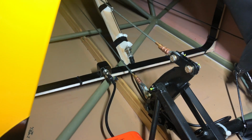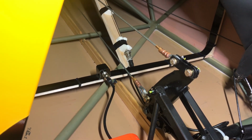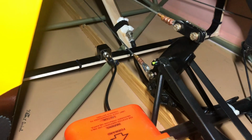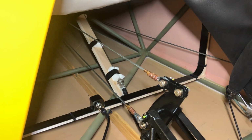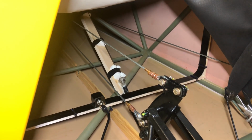And I just took a piece of 1 inch wide balsa wood, I think like a 1/4 or 3/8 thick. And I think I glued it, or zip tied it down to the frame, and then ran the sides. The sides go up about 10 inches or so on both sides, and I can hear traffic 200 and 300 miles away, so it'll reach out that far and hear that far on a handheld radio off of this antenna.